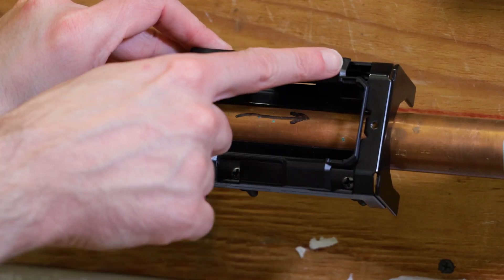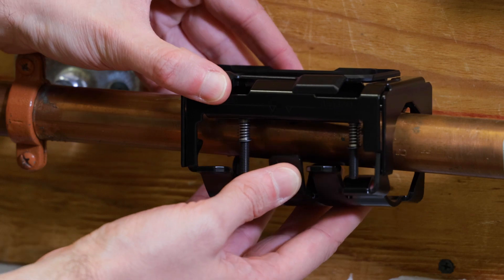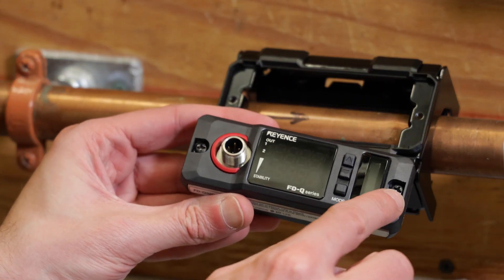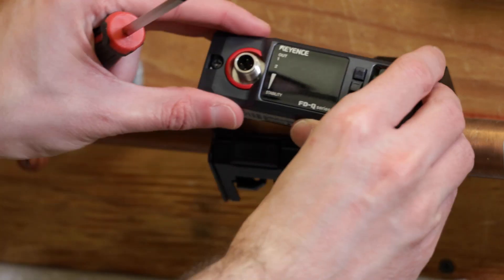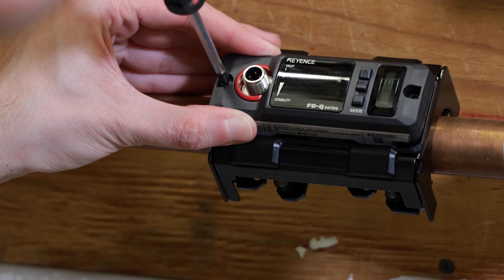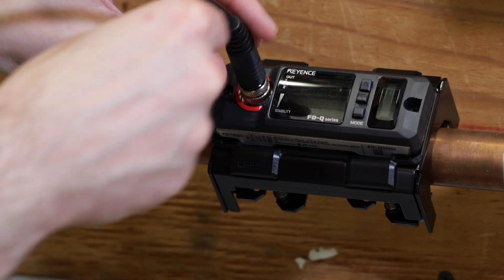The controller mounting ring slides out of the way to expose the four bracket mounting screws. On a clean, smooth section of piping, straddle the pipe with the two sections of the bracket, reinsert the screws, and tighten them evenly in a star pattern until the bracket is snug and doesn't spin or slide. Slide the controller mounting ring back into position, then carefully reposition the controller within the bracket with the display screen upright and clearly visible. Tighten the two screws evenly so the controller is securely attached to the bracket. A good, firm installation will ensure a strong sensor signal and accurate readings. Insert the black 4-pin connector on the black cable into the controller and then thread the locking ring until it's snug.